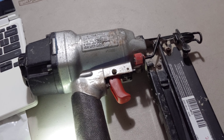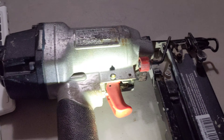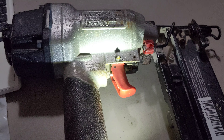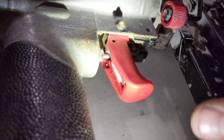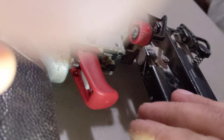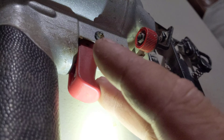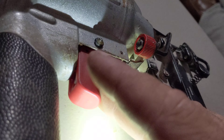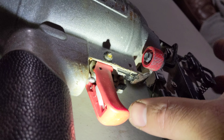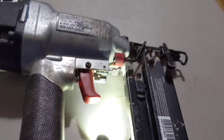I'm going to put it back together now. The new trigger is in the tool. You can see that now when the tip stock is engaged, it does what I thought it should do. Without the contact tip engaged, the solenoid is not triggered because there's a void in the trigger — that block is down. When the tip is engaged, it slides up that block and then it does actuate the solenoid. So there we are — let's go test it out.